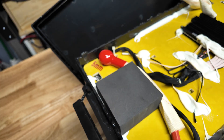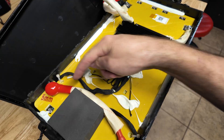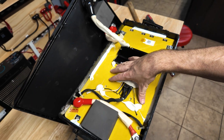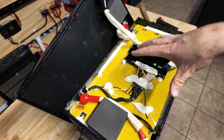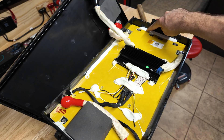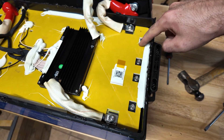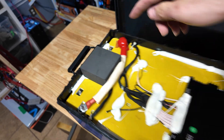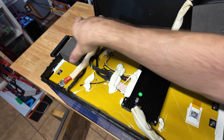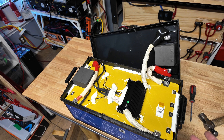The Bluetooth address sticker is for the BMS itself. There's some nice foam on the cover pressing down on the cells. The connector most likely joins two 8-cell strings together — eight cells here, eight cells on the other side — to make a series connection, giving you your main positive and negative. I'm going to try to get the large fiberglass sheet off the battery. The cells and everything are tucked underneath it, held down with epoxy around the edges. You can see cell holders — four on this side and likely two more on the other — and metal straps compressing and holding all the cells together.